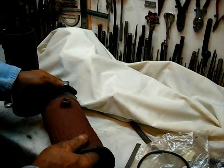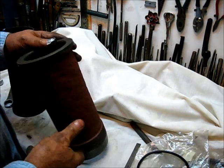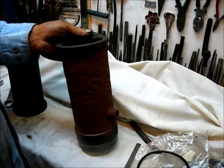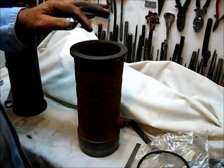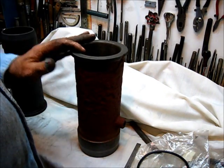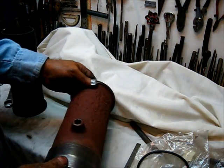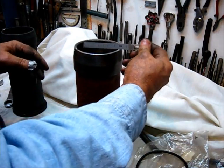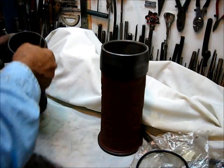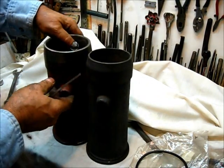Nowadays you don't have a choice — if it's bad, it's bad. These can be re-sleeved and it's not that big a deal for a machine shop. If you've got big enough equipment, it's a lot easier to re-sleeve this cylinder, bore it out, press a sleeve in there, and then turn that to the piston size. You can bore these out and put an oversized piston in there, though oversized pistons are not available. The comparison is this: if you measure them, this one right here measures out three and five-eighths, and this is the igniter model. And immediately you can see the difference there.